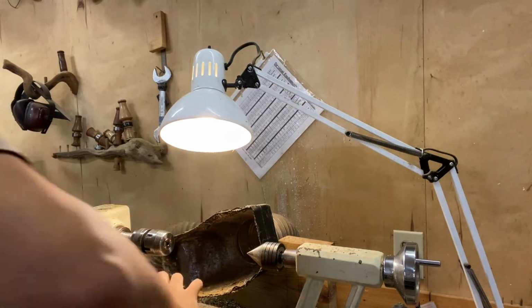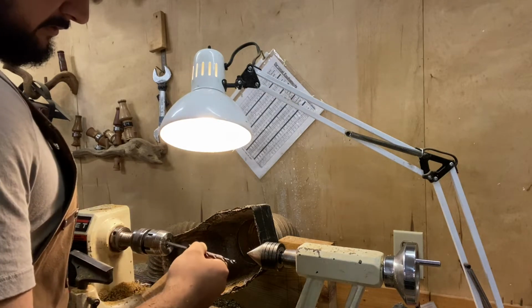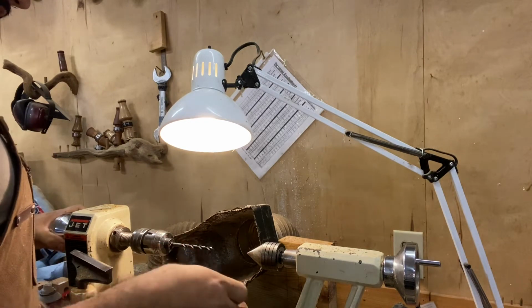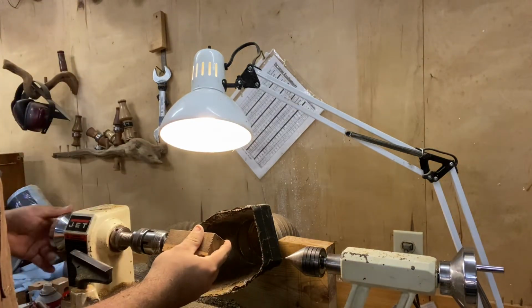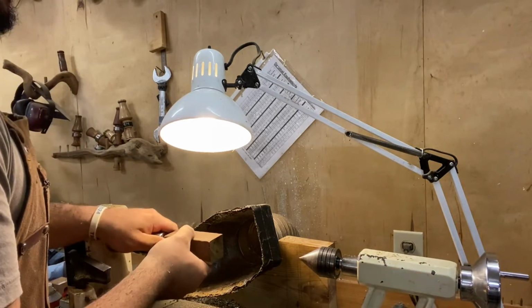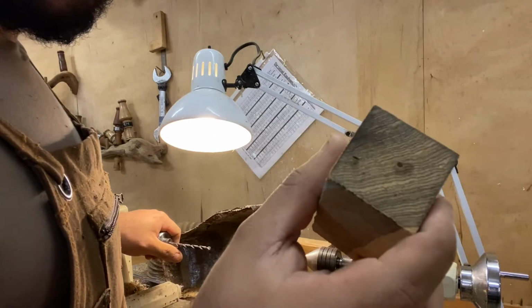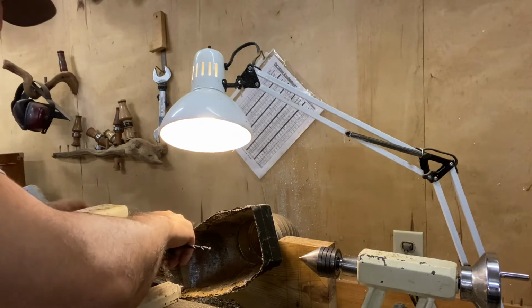So what I'll do is I'll go get the drill bit I used. This trick does not work often. It only works if you drill it the same day, but I'll get the drill bit I used. I'll stick this on there. That way everything's straight. You can do the same thing if you have an indent tool, but if you can see, there's a small dimple now. So that tells me where I need this to line up. Everything's straight now.